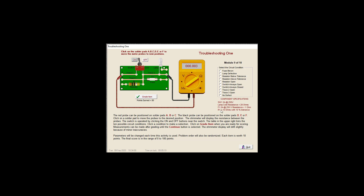42, 41 — that's close enough for our lamp. Fuse is good. Traces are good. 10 — way too low for our resistor. So let's check our switch — perfect. So we've got a resistor — let's see, higher or low. 10, and it should be at 12, so it's way too low, below tolerance.